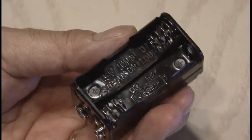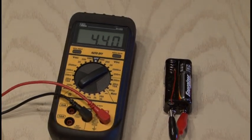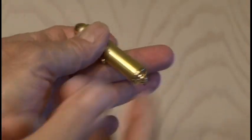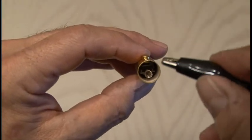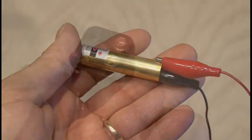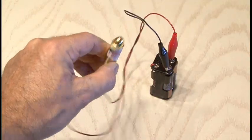First, we'll need to build a battery pack for our laser pointer. I have a 4AA battery pack, but we only need 3AA, so we need to run a jumper to complete the circuit for the last battery — that'll give us all 4.5 volts that we need. Now we're going to disassemble the laser pointer by taking out the button cell batteries that come with it and then running jumpers. One will go to the contact inside the laser pointer and the other will attach to the actual housing of the laser pointer. Then we'll hook those up to our new 4.5 volt battery pack and test it out — and we have power on our laser pointer.